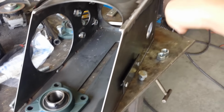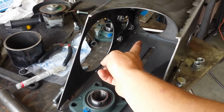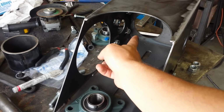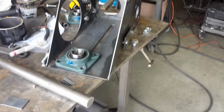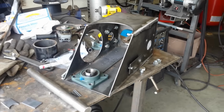And there's an arm right here that basically allows you to adjust the pivot point, the half inch rod that holds on to the lumber. You can fine tune it up and down away from the blade to get your exact fit for your tenon if you would like. So anyway, this is exactly what I'm doing right now, and we'll see how it goes.